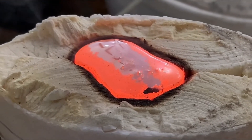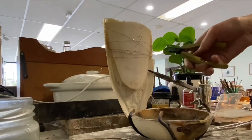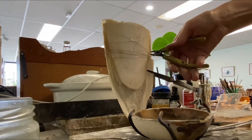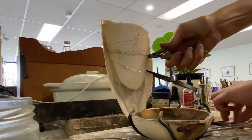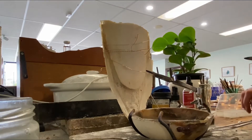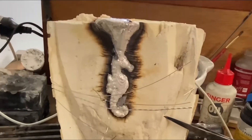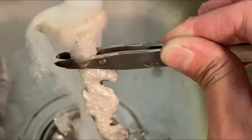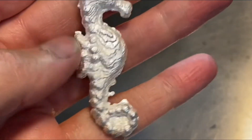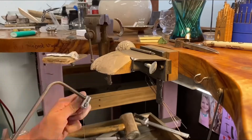After pouring, wait a few minutes for the metal to cool down. Once it has, you can cut open the wire and see how you went. Remove the metal with tweezers as it will still be hot, and run it under cold water. I am really happy with how this turned out. After it was dry I used my jeweller's saw to cut off the sprue, which is the excess metal, and then I spent some time cleaning it up and polishing it.